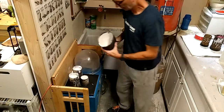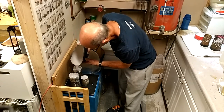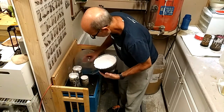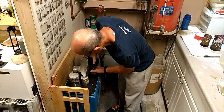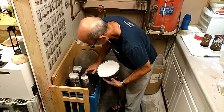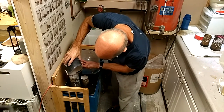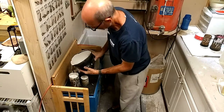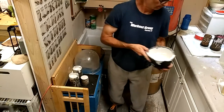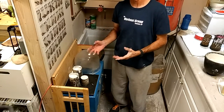I'll take a little extra and pour it on the top here — those waxes were pretty tall. I haven't found that this causes any problems either. So now we'll just let that dry. Once it dries we'll pop the bottoms off and it will be ready to go into the oven.